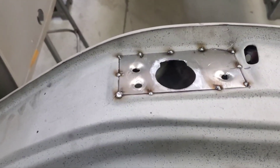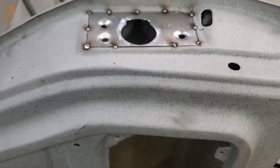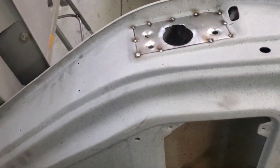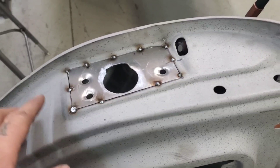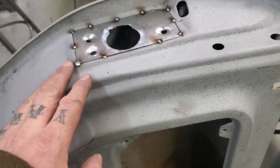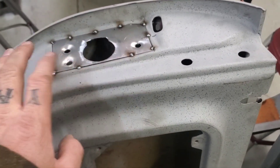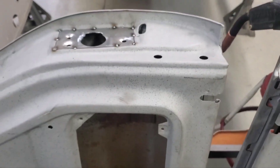You can see I've started tacking the piece in — small tacks spread out. I like to use air to keep my tacks cool. I've seen guys use wet rags, but to me that just seems like a bad idea since you went to all the trouble to clean the part you're working on. So we'll slowly tack this in, keeping it cool, and get the other one in. I'll continue welding these in and start cleaning them up. You've got to go slow and keep it cool, so it's going to take a little bit, but I'll come back and show you guys what the mostly final product looks like.